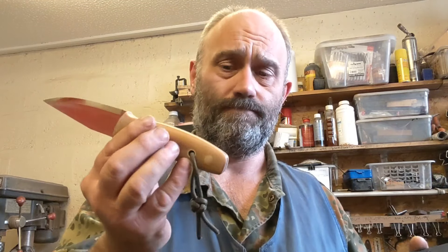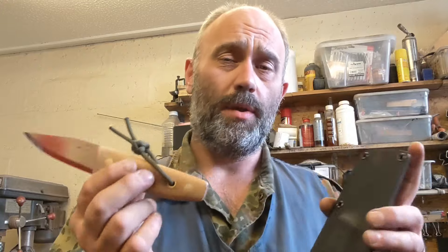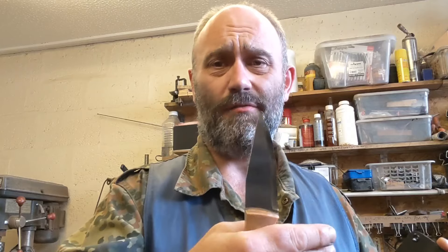Next up I've got two in natural canvas Micarta. I've got a soft spot for natural canvas Micarta — it's just nice and simple, it reminds me of a wood handle but without the problems of a wood handle. Same thing with brass bolts. There are no protruding tangs on these because I'm stopping doing the protruding tang unless somebody asks for it. I just don't see the point — I like it on the Mark One because it has a more robust blade shape, but these are more meant for carving, more of a professional knife, so you're not going to smash it through logs given that thinner tip.